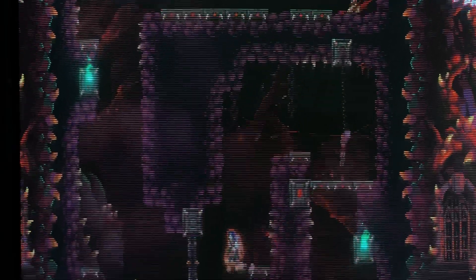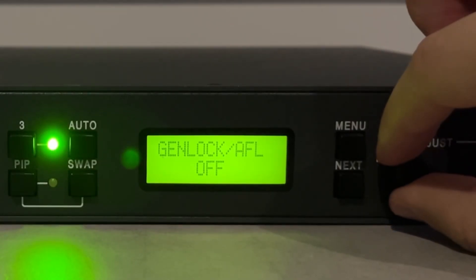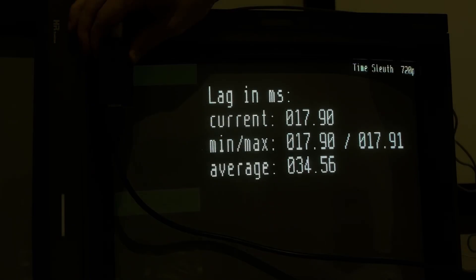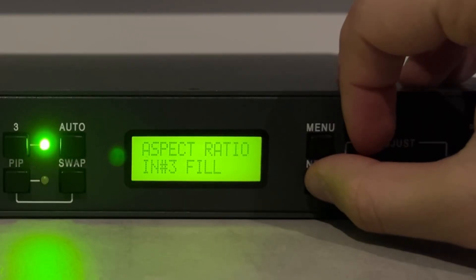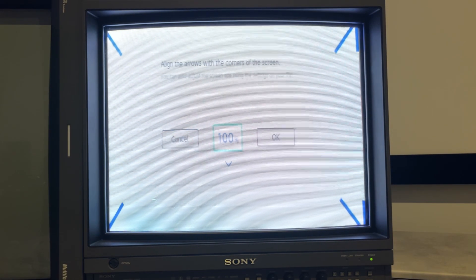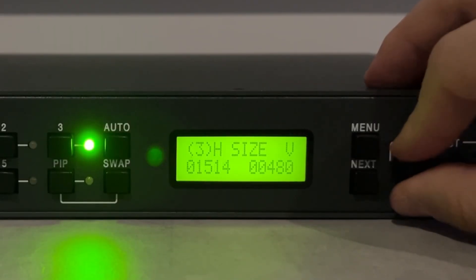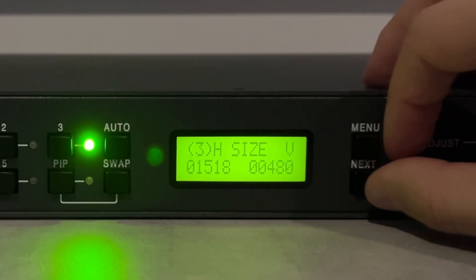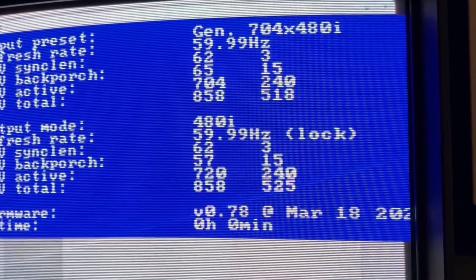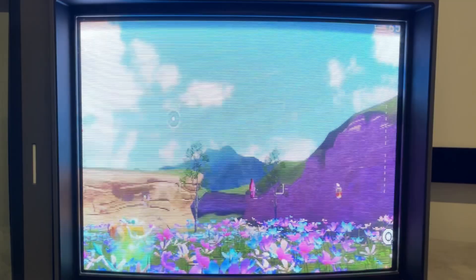I failed to realize in my last video on the Extron EDID method that turning AFL (Automatic Frame Lock) on keeps the lag steady at only one frame for progressive sources. With auto image set to fill, the picture is going to be heavily overscanned and discolored — just go into the output settings, reduce the horizontal size to somewhere above 1500, and re-center it. The OSSC Pro then reports the output as 704x480i.